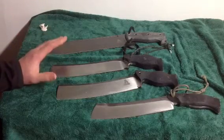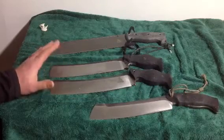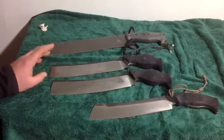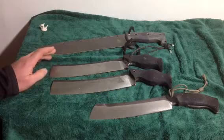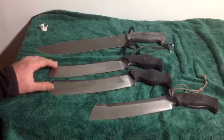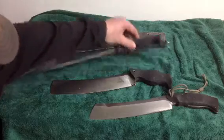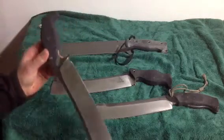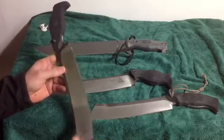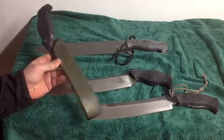These are some practice blades now, but they used to be blades I competed with. They've been reground a couple times, and one of the things I do with my competition blades is I grind them very thin for their cutting edge. When I practice with them, if I hit some really hard materials or actually mess up my technique, they can ripple the edge. And this is an example. This edge, you can see, has some wobblies there. It's hit some pretty hard knots, and since the edge is so thin, they've just kind of rippled, but they work good for practice blades.